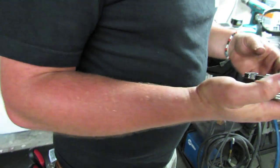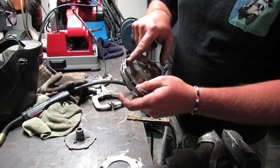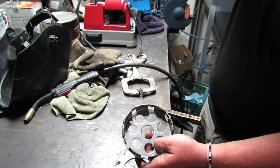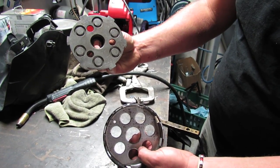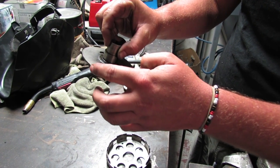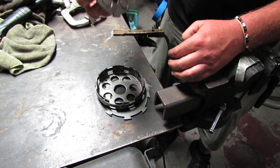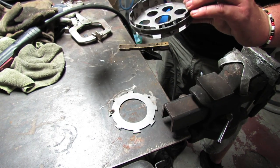At this point the thing's basically done and ready to assemble. One final thing: now that there's very little void between the fingers of the clutch basket and the band, the backing plate and the two bottommost cork plates may not drop freely in. You can see the difference between the six-spring and seven-spring versions. You may need to take it to the bench grinder and remove a tiny bit of material in intervals to make sure everything passes freely. We call this the 'bend jammer test' — you never want to have to hammer or tap it down past that band.